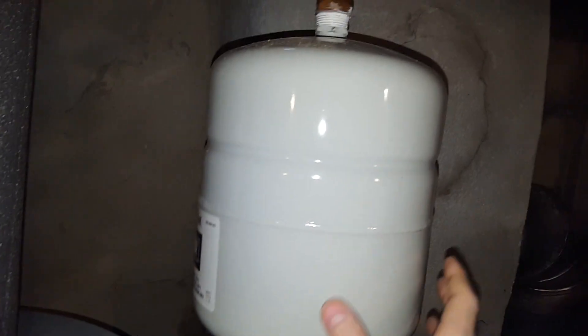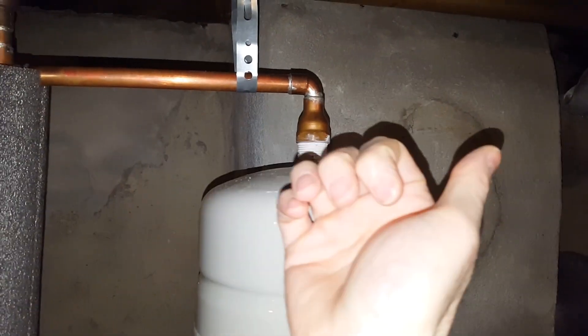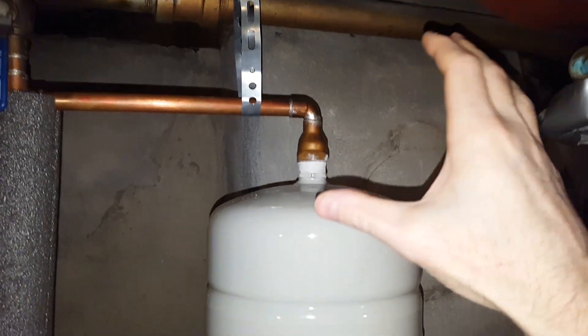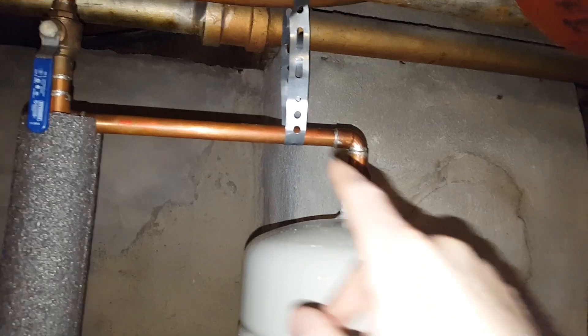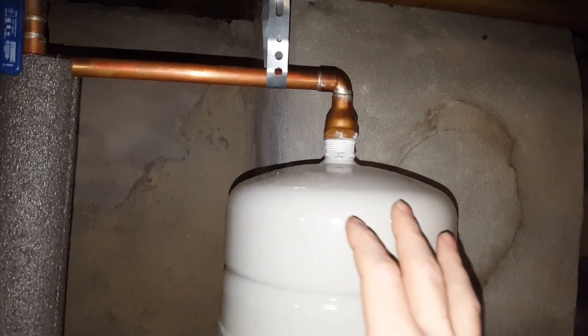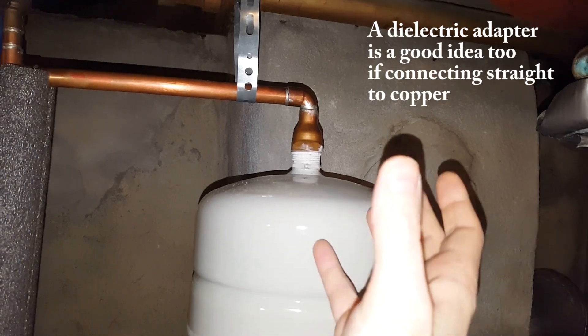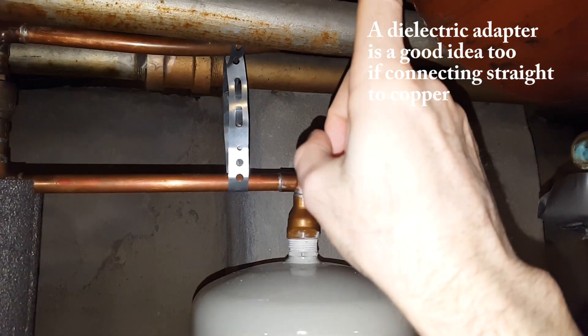This should have a brace to hold this. It can either be installed up or down, or installed sideways — but that's a little dangerous in case it fills with water, because if this breaks off, there's nothing to stop that water from flooding your house and your basement. So you want to make sure that it's installed correctly. Vertically is a better way to go.